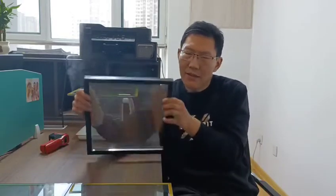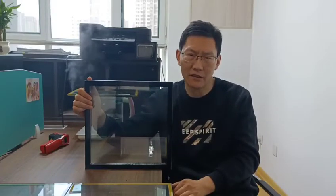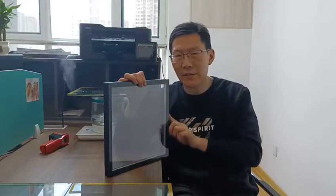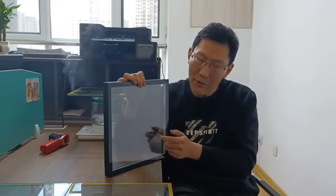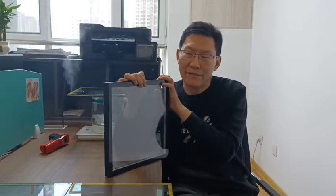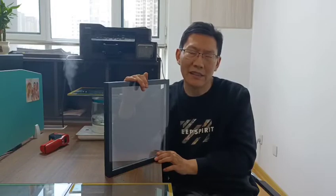In this video, we will explain what vacuum glass is, and we will also do a small test showing the extremely low thermal conductivity of vacuum glass. So first question: what's vacuum glass? This is a standard double glass unit that is widely used in our windows, doors, and facades. It's a sealed unit made with two pieces of glass, but the glass are separated by aluminum spacers or warm-edge spacers, with low-E coatings inside. Actually, till now, it's still the priority of architects when they design a new project.